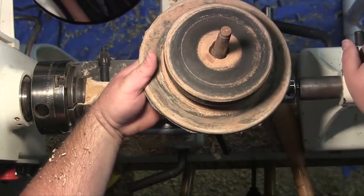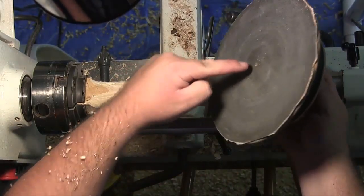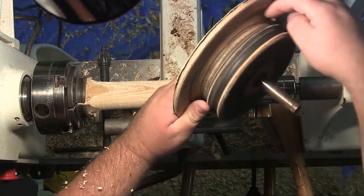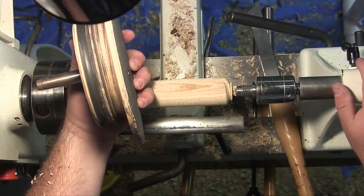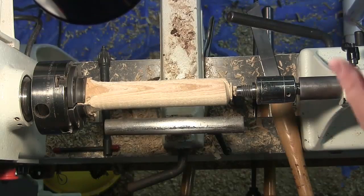This is a Morse taper that has a bolt that runs through it, a little flathead that's been recessed in here. And then all I've done is come in and scrape grooves in here so I can sharpen on the lathe whenever I have to. Nice little compact small thing. But if you've got the Wolverine there, fantastic. That's great. All right, let's try this again.